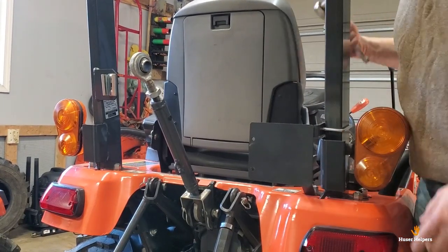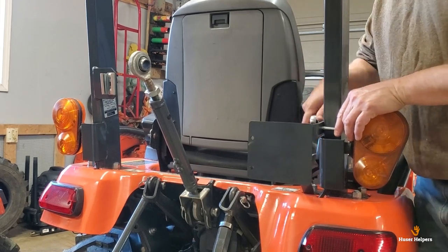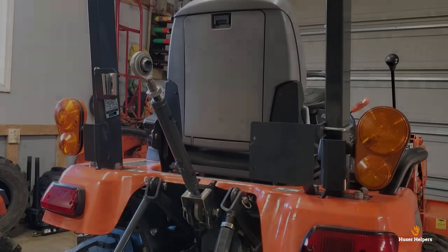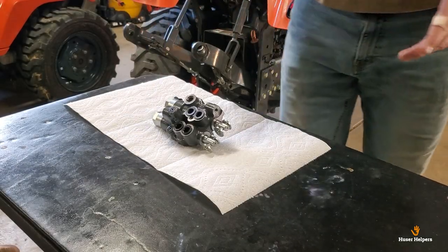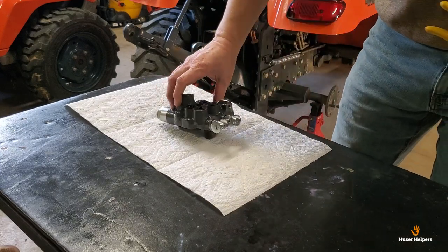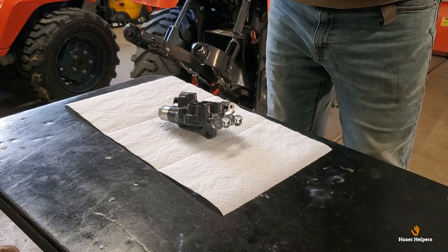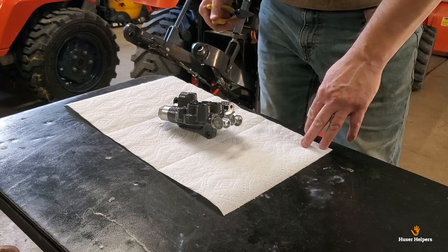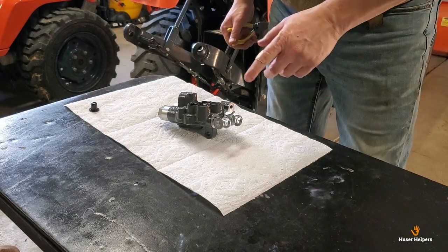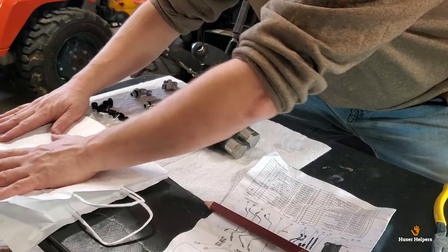It's a three-quarter inch socket on the ROP structure, and on this U-bolt it's actually a half inch — I figured it'd be metric but it's standard for whatever reason. Now, anytime you're working on hydraulics or anything with sensitive stuff, you should use a lint-free cloth or lint-free towel like Scott's towels or the blue rags. I left all my orifices plugged until I was ready to start using them, so I'm going to pull those caps out now.